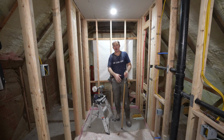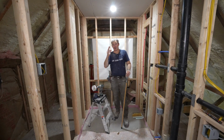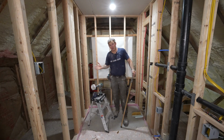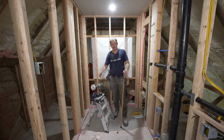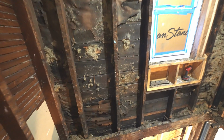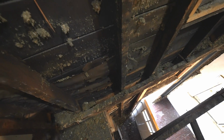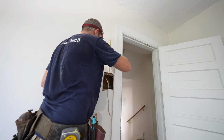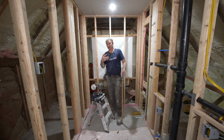But I just wanted to go over the business aspect of it, trying to evaluate what it's going to take. Now, there's two components that I think you really have to pay attention to, and that's the age of the home. If you're built before the 1930s, it's actually fairly easy to run a wire down to the main panel because it used to be balloon framing that went all the way down from the first floor all the way up to the attic space. So it's usually a clear path all the way down, and you can just take a fish stick and run that wire down. It's usually pretty simple, especially since most basements were unfinished back in the day. So it was really easy to run a wire.